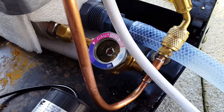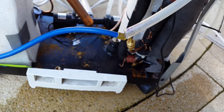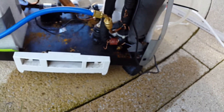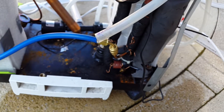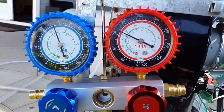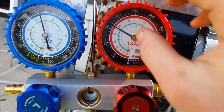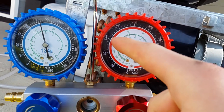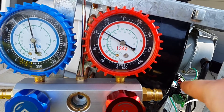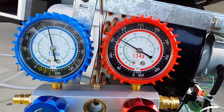The moisture content is still a bit too high, and that's the amount of condensate coming off it, which seems about right. I was looking at the pressure-temperature app on my phone — it's a refrigerant slider from Danfoss — and the pressure exactly matches the temperature of the water. That pressure there responds exactly to the water temperature, confirmed against the thermometer.